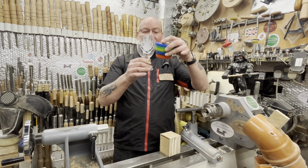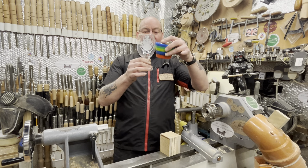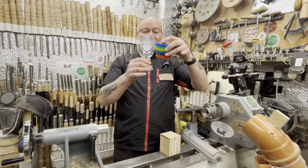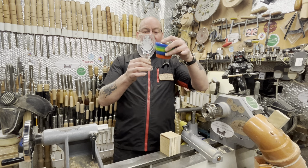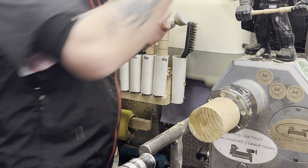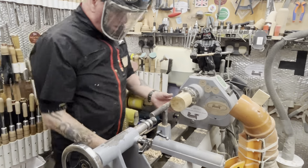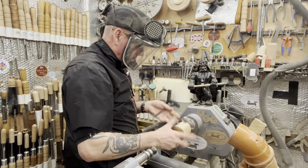What I'll do is — because it's gone from centers into the chuck — I know that's straight. I'm going to start it up and start a flat on the front. I'm going to use the carbide to take a very slight inwards slope on the front of this — not even a millimeter — just a very slight slope into the center. That's what I want to ensure there's going to be some glue in there.